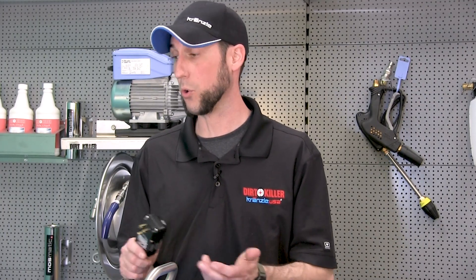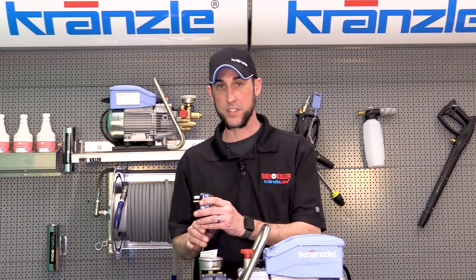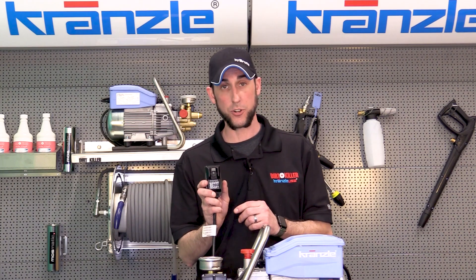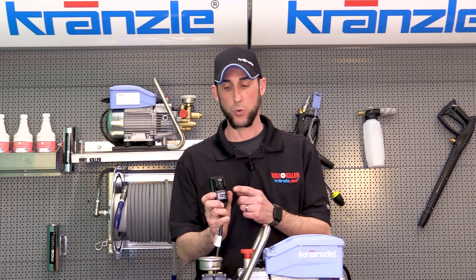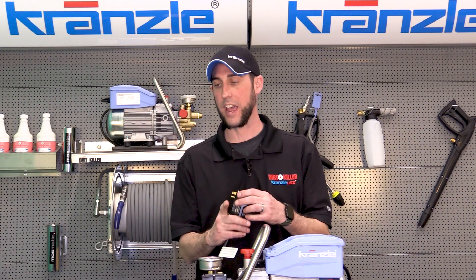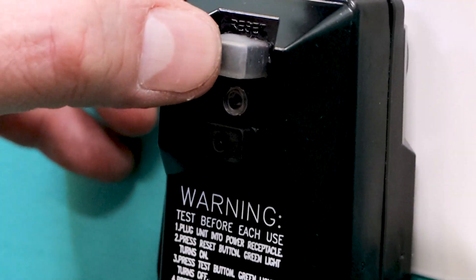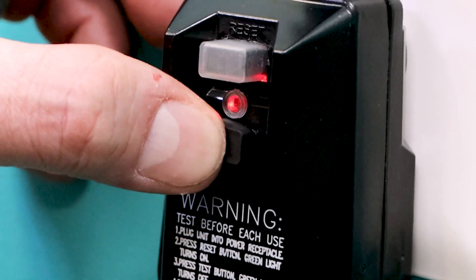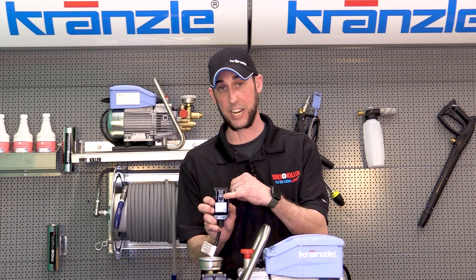The next question is: how do I know whether it's tripping or whether it's failed? The first question is going to be: when I plug this in, has it actually engaged and then tripped? Not every GFI is automatically going to be engaged when you first plug it in. With this particular series of GFI, every time you unplug it the GFI trips, so when I plug it in I have to press the reset button. On this particular GFI you can see a light in between the buttons that will illuminate when it is engaged.